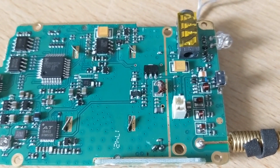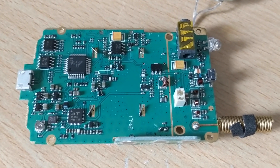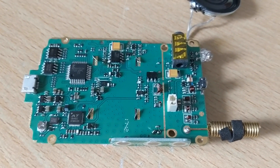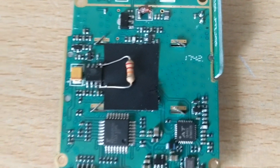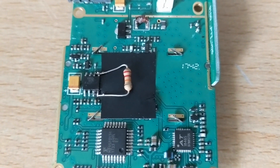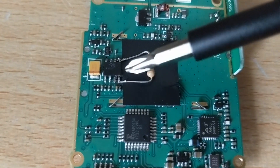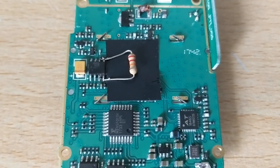You can do this one of two ways: you can either put a piece of wire and a resistor in-line, or you can just solder the resistor straight to those two pins, and that should remedy the sound. I'm not going to show you my soldering because, let's be honest, it's shocking. I've just soldered the resistor in-line — the two end pins. You just put a resistor in-line with the two end legs of that chip, and a little bit of insulation tape underneath just to protect it from any shorts.